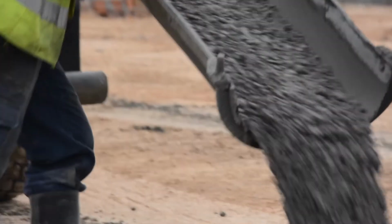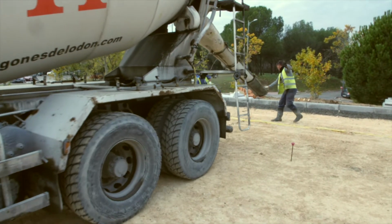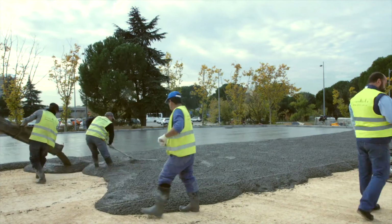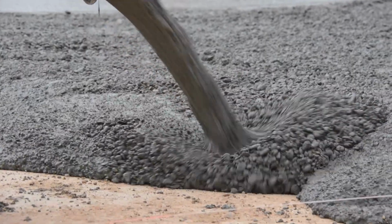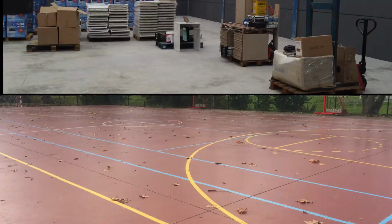The fibres are easy to transport and economic to store. We avoid cutting steel mesh around columns and other obstacles and in areas with difficult shapes. When it's a covered car park with columns and other obstacles, you have to cut and straddle the steel mesh. We also avoid mesh placement problems on sloping terrain and with varying thicknesses.